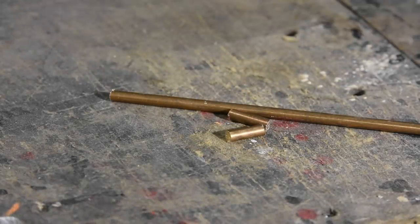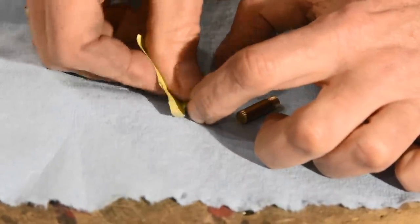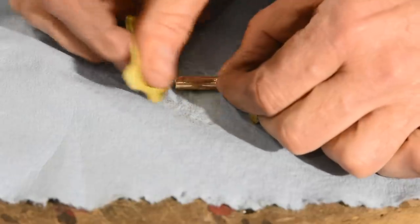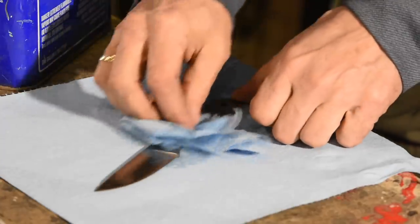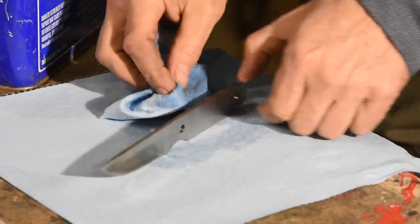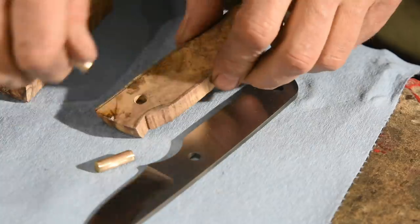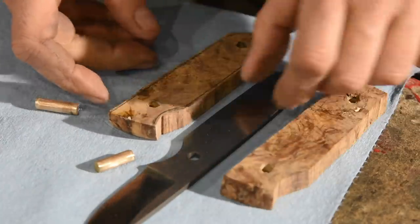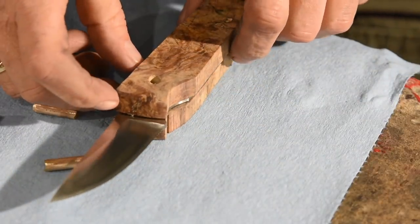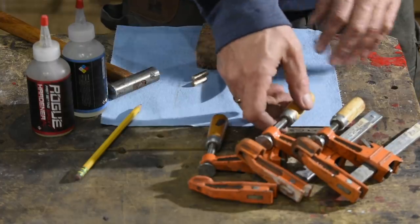I'm using a pair of brass pins cut from brass rod that you can buy at any hobby store. After cutting and deburring on a piece of coarse sandpaper, I'll clean off the oxides — this will help the adhesive bond better when we assemble the blade. Before assembling, I'll clean and degrease the blade thoroughly so it will adhere properly to the epoxy. Before assembly I always try to run through my assembly process in my mind, making sure that all the parts fit correctly and are oriented so I won't do something dumb by mistake. 27% of knife making is just making sure that you don't do stupid things. I've got all my parts, hammer, clamps, and so on ready to go.